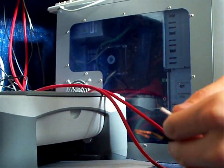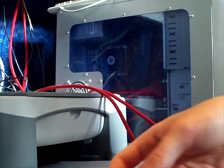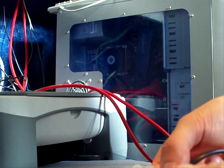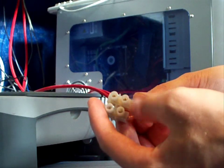When you're connecting wires together guys, never, never, never just twist the wires together in any way — that's not safe. The way you want to do it is you want to use what's called a chocolate bar or binding posts. You just shove the wires in either end and screw them down nice and tight, and that way they're not going anywhere and it's the safest connection you can make.